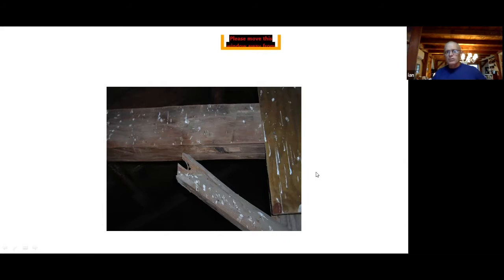If the joinery has not pulled apart and the foundation has only failed a little bit, I have a choice: I can stabilize the barn in the shape it's in, which is a lot less expensive than picking up the frame, leveling it, plumbing it, and putting it back into its original shape. The damage to the frame is going to determine that. When you see a barn where joinery has started to pull apart, you'll often see cabling from one side to the other and iron dogs — horseshoe-shaped pieces — used to hold it together. Those are all band-aids and they're not solving the problem of foundation movement.